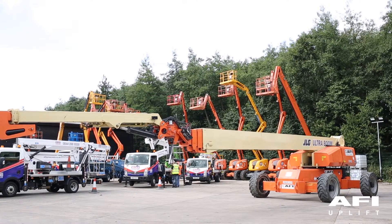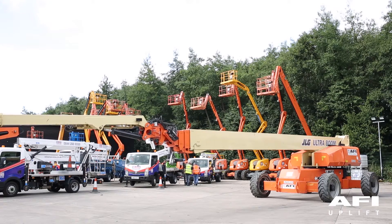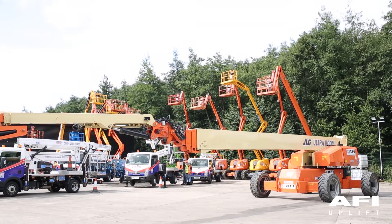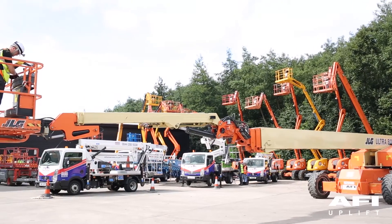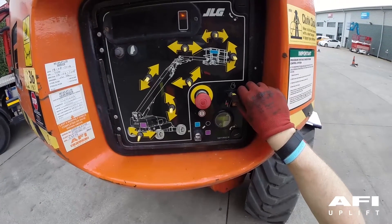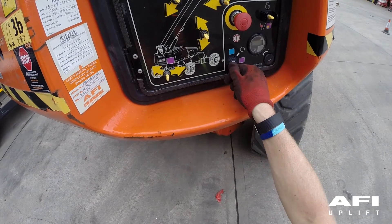Stability: Machine stability is based on two conditions called forward and backward stability. To avoid forwards or backwards tipping, do not overload the machine or operate the machine on an out of level surface. To shut down, remove all load and allow the engine to operate at low speed for three to five minutes to allow reduction of internal engine temperatures. Push the emergency stop switch, turn the key from either platform or ground position to the off position and remove the key to secure the machine and prevent unauthorized operation.